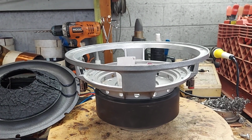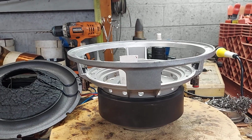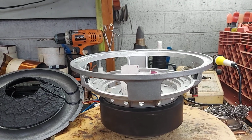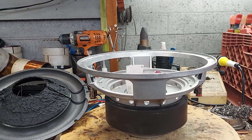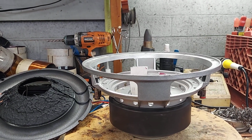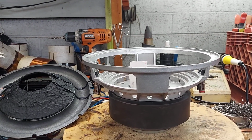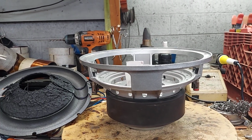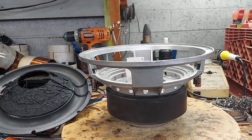Again, somebody else was talking about Power HX2. Everybody loves that one, right? Well, the original ones used a heavier copper coil, and they sounded really amazing. But Rockford switched to aluminum to save money because the price of copper started going up, and aluminum is much less costly than copper. Then they go, well, we can't use the same suspension, so they lightened up the suspension. What do you know? You save money on the suspension as well. And then they kept the same rubber surround.